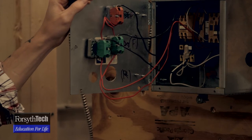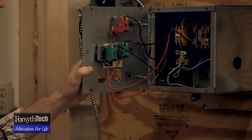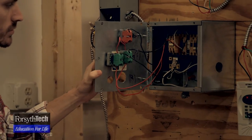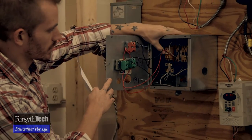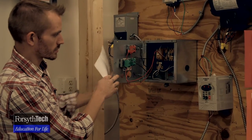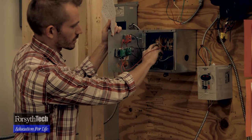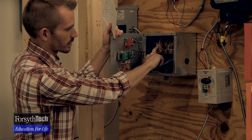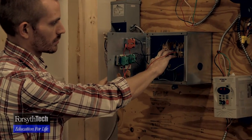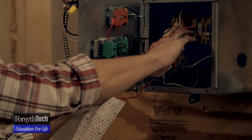We kind of upgraded, but I can show you pretty much how it works. Initially, how you would start it: you would press forward and the way the contactor works, it has a holding contactor. You would push forward and it would energize the holding contactor and lock it in — so you don't have to continuously stand there and hold the button.